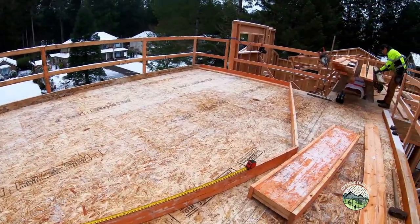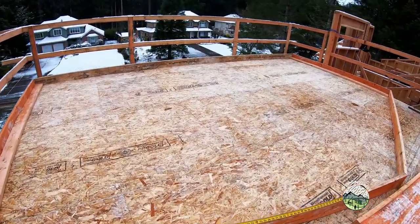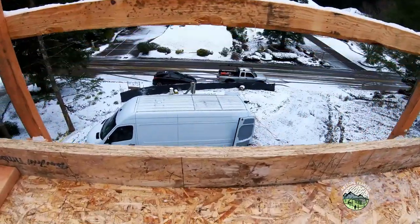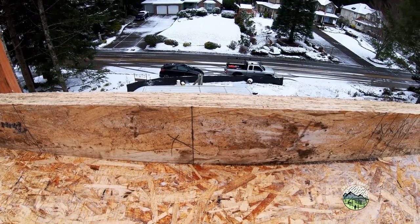We've got just a little rake wall — 9-foot walls with a 4/12 pitch on top. Nothing too crazy. Let me just run you through layout real quick. We always want to cut our studs to the sharp of the bevel, which means we lay out on the long side, X downhill.